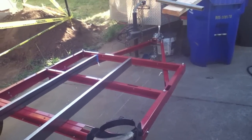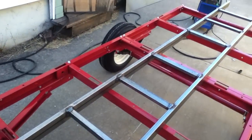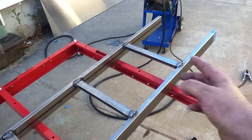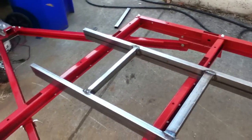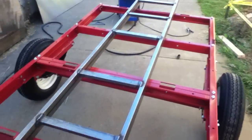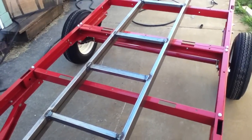That was a big intro. The next parts of this video are going to be relatively short. Cross braces are welded in — I welded the frame upside down so I could use one of the original trailer's cross braces to help square everything up. Then I welded basically the U-shape from the other end, flipped it over, and welded back on the tops. If I weren't as concerned about sealing everything up, I probably wouldn't weld all the way around — it's not absolutely necessary, but it helps maintain strength when we're not using thick metal.